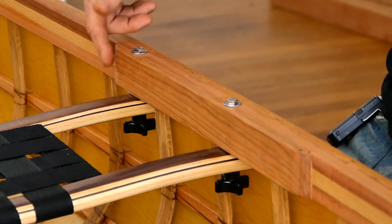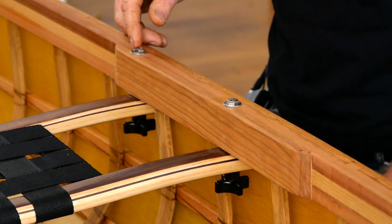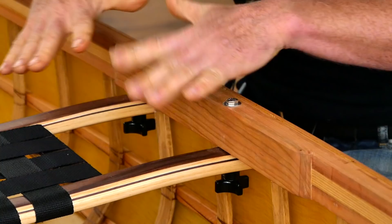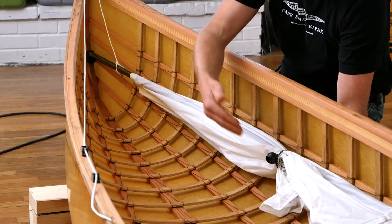I really enjoy working with the cherry — it looks a lot nicer with the red cedar than the ash I've used in the past. A minor detail I also carried over from the last boat: instead of using T-nuts mounted into the bottom of the seat rails that I drive bolts down into, I went with a simpler arrangement where I drill straight through and put a star knob on the bottom. I like this because it's a lot easier than trying to reach under there and ratchet on bolts, especially if you're putting the seat in and out frequently to nest a canoe inside. The downside is extra pieces to lose and the possibility they could loosen up, but if you monitor them once in a while this is a really easily and quickly removable seat arrangement.